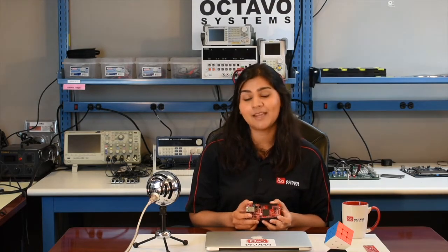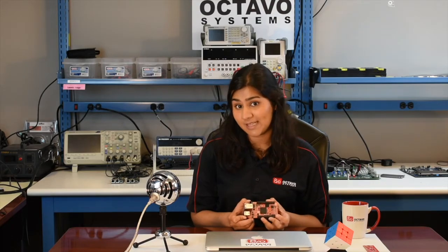So now that we've seen what the RED board offers to the developer, I'm going to show you how you can run a program just to see how easy it is to do so. This program is simple and was actually designed by our marketing manager, who had limited experience with embedded systems. The program takes accelerometer, magnetometer, gyroscope, and temp data from the IMU, and altitude, pressure, and temperature data from the barometer. It then displays this data on the screen using charts that update every 50 milliseconds.